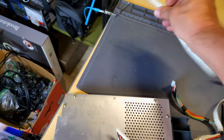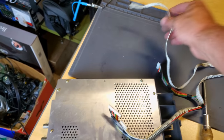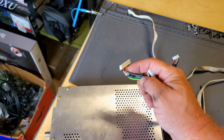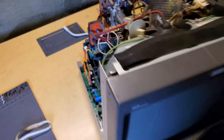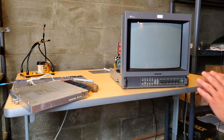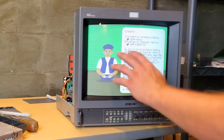Here's the board I've removed — it's the BKM-101C component SDI video kit, and it is fully shielded. I've also removed some cabling here. The longer cable goes into the power supply, so I've removed it — it connects power to this board. Then this other cable goes into our main board, so it allows the SDI board to communicate with the main board and video inputs.